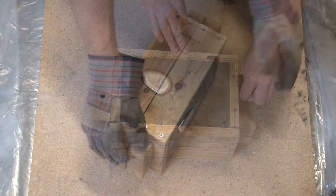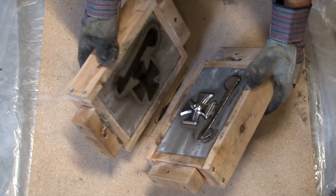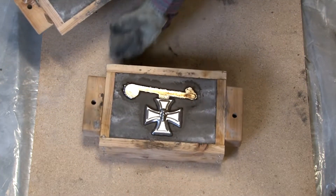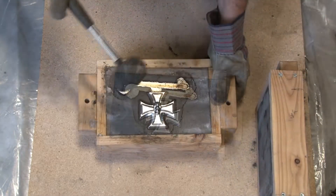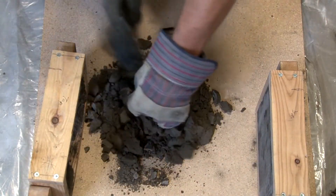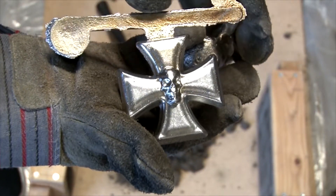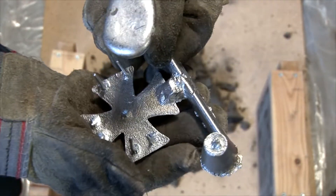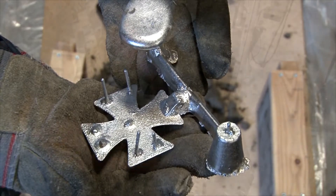This is my favorite part — opening a mold and seeing how it turned out. This one turned out really good. Look how shiny that is, the surface finish on the part. This has the best surface finish I have on a part right now — I haven't had one that turned out this good yet. I'm going to flip it over and you're going to see the vents where the aluminum went up. I can just take a pair of pliers and snap it off, then sand it the rest of the way down on a belt sander.